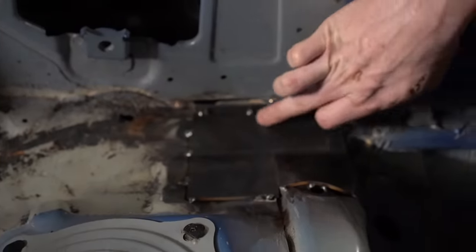Donnie and I have completed the front boxes. If you take a look in here, we've got our platform for our tube landing and then all of our structural bracing all in one plate. We beef up the rocker of this car. We give it a good foundation to land to, with enough space to weld all the way around the tube.